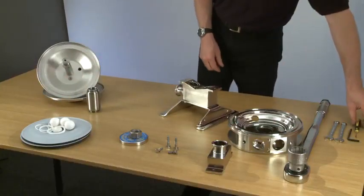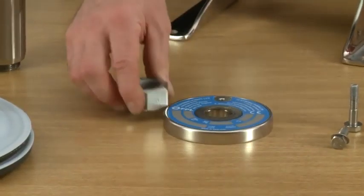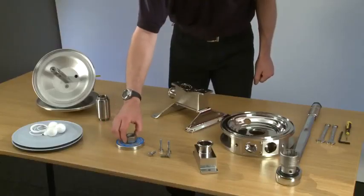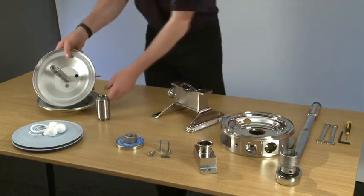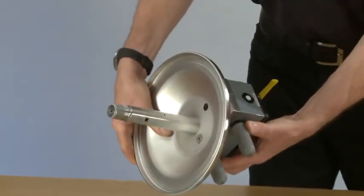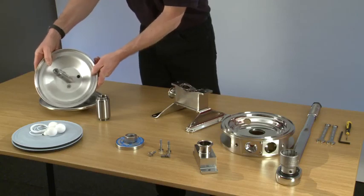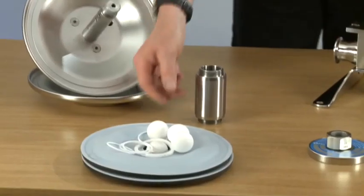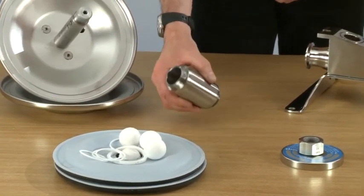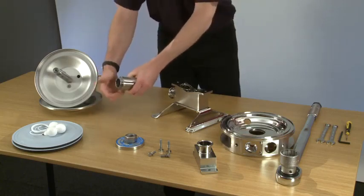Here we have the pump, fully dismantled. We started by removing the main nut, the dome washer, and the rod washer. We then took off the secondary dome and slid out the primary dome, air system, and air valve all attached. We then unscrewed the first diaphragm off of the thrust tube, and removed the thrust tube complete with the second diaphragm, and then dismantled it when it was out of the pump.